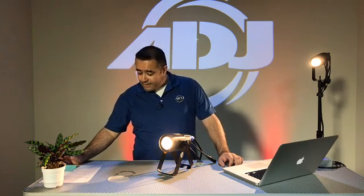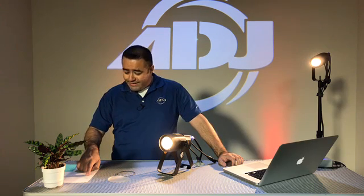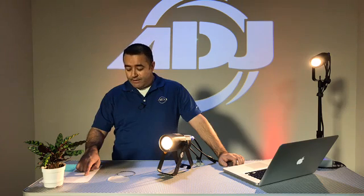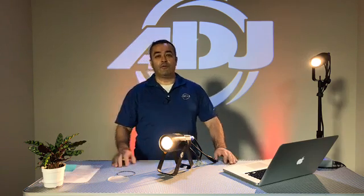What is the LED brightness on the fixture? LED brightness on the fixture, we're looking at 726 lux at 3 meters. And the CRI, which is a really great CRI, at full on is a 92. The CRI is color rating, and that gives you very good color rendering if it's a high number.